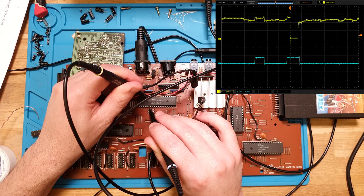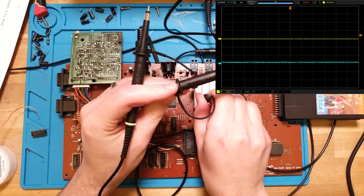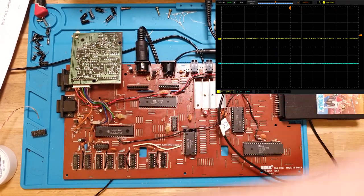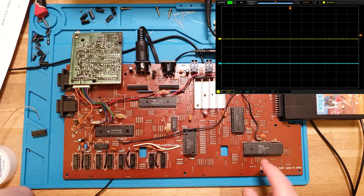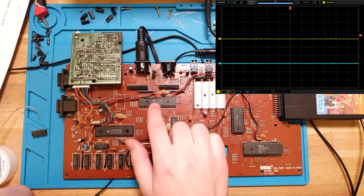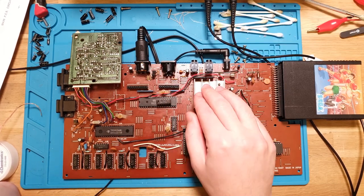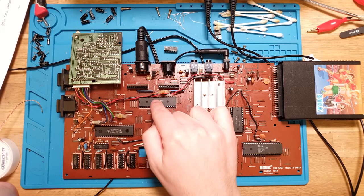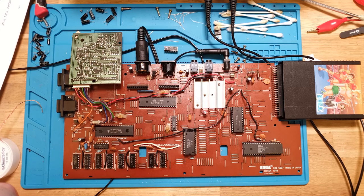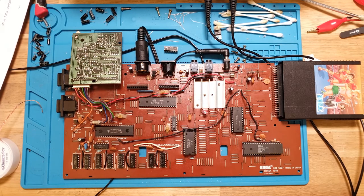So, yeah. No. This is telling me that the PPI is busted as well, which is a bummer. I'm going to have to go online and see if I can source a replacement for that, because unfortunately I got the Z80 and a SRAM chip salvaged, but I don't have one of these. So I'm going to also just double check that this logic, I'm going to punch that into my EEPROM programmer and see if I can get that tested, but I don't think that's faulty, just based on what we're seeing here. I think this D8255AC NEC IC is also faulty. Yep, I guess I'm going to have to leave it here for now, because I'm going to have to go online and order another chip. And I guess I'll be back when probably China comes through.